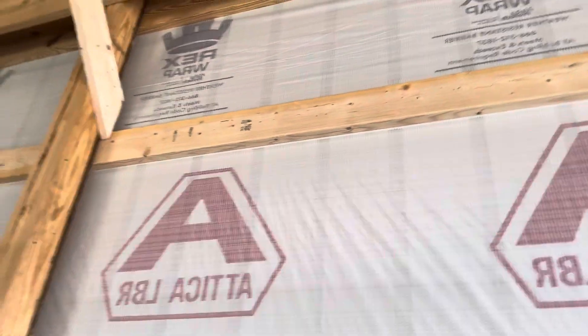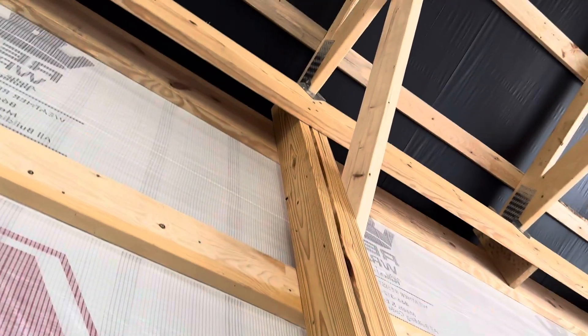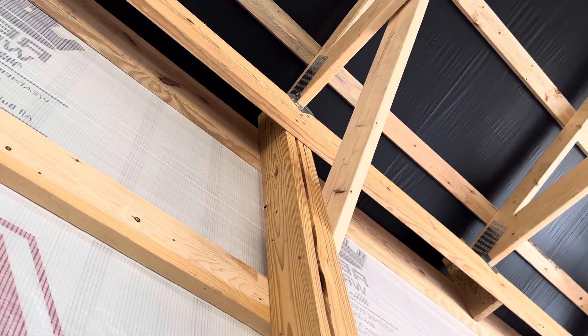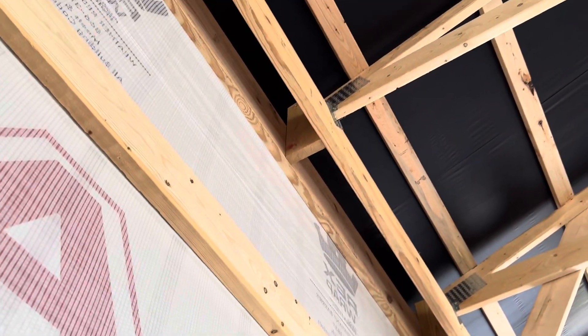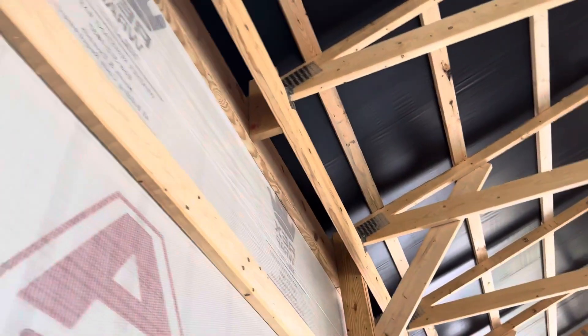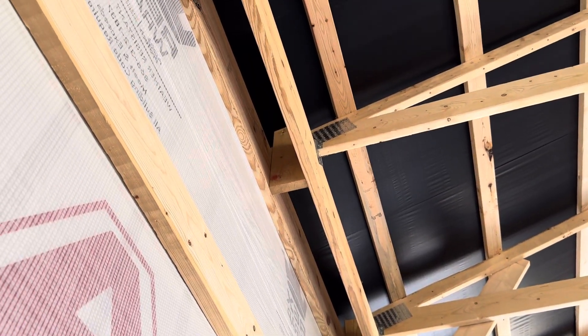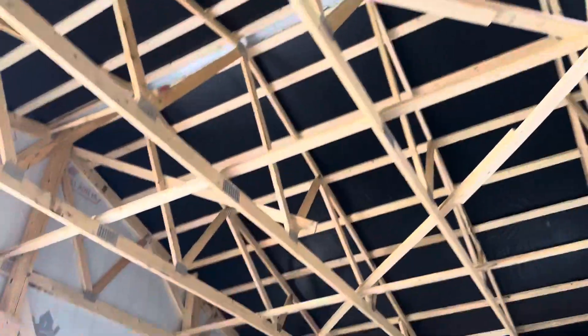I haven't talked about this in a while — you see how we do those truss blocks up there? So if we notch it here on that three-ply laminated, you see that truss right there? Again, 32 feet. You can see a two-by-six bottom, two-by-four top cord. You can see right there on the three-ply, the truss sets right there — we use a two-by-six to keep it tighter. That kind of gives you an idea.